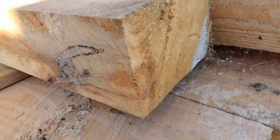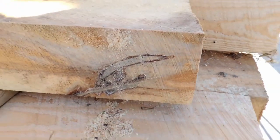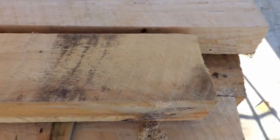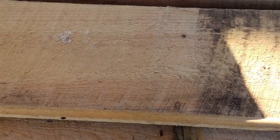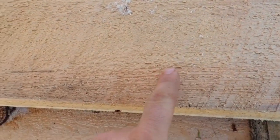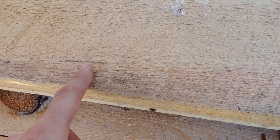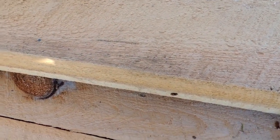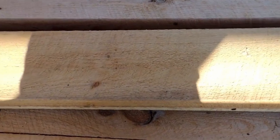Moving along — this next video was about timber selection and floor joist selection, showing things to look for and avoid. There's some pretty good grain runout on this five-by-eight floor joist. These I did not mill myself — I had them milled up by the Amish using an old circle mill that's kind of out of whack, so things are a bit out of square and the consistency isn't quite there from one end to the other, but they were good enough. They did not box the heartwood — we've covered that extensively on the channel and we're going to do it all over again on the next project.